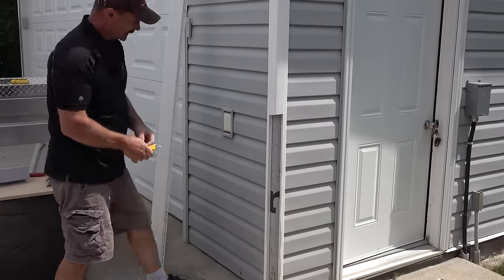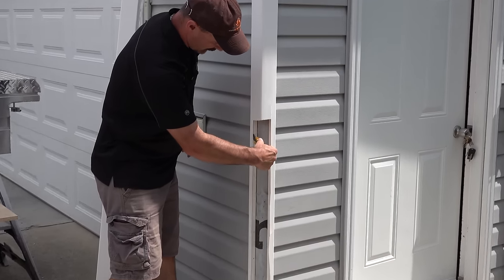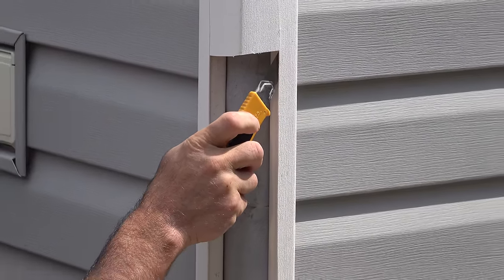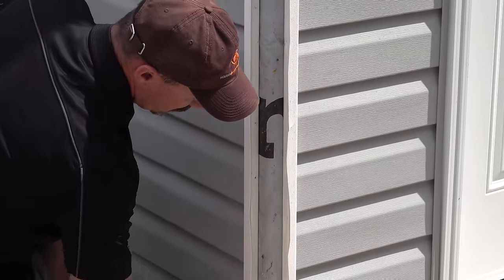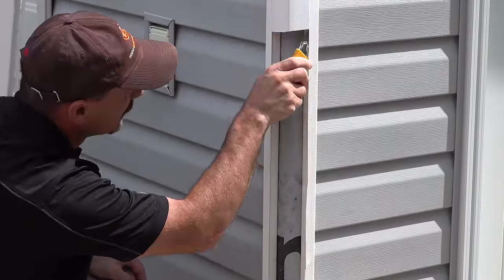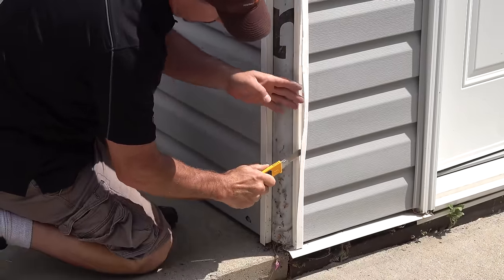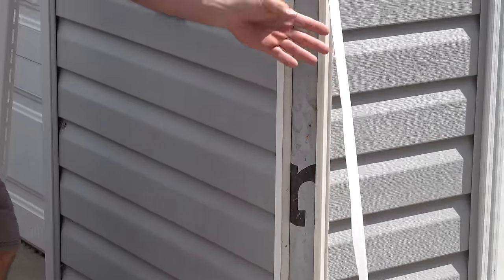Okay, that's garbage now. You can see it's exposed this inner lip where I want to stick my blade way back in there and cut on this edge here. I'm not trying to cut right through on the first pass — I'm just trying to score it. Be careful: if you're pushing too hard and your blade comes through, you might scratch your siding, so just be leery of that. Usually if you make two or three passes it's going to start to break its way through.